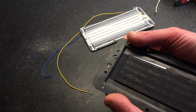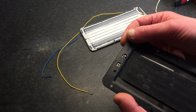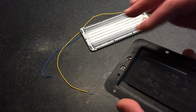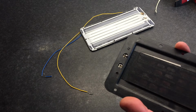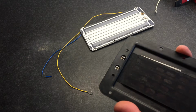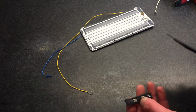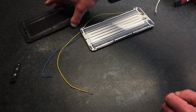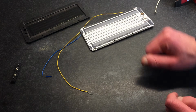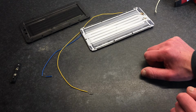And then they put it in, probably after you foiled the whole thing. Then it's sitting really close to the mylar, and they just burn through the mylar and solder it with some sort of special solder that will solder aluminum. But yeah, it is quite easy to mess up, of course. They do mention it in the data sheet as well: you should not use too much heat because it will ruin the thing.